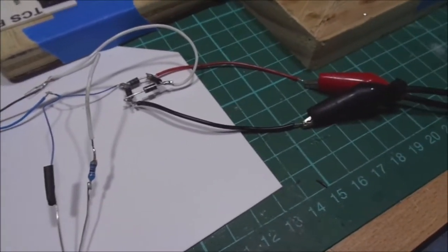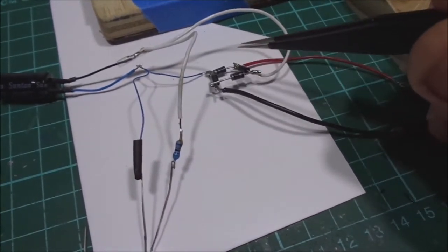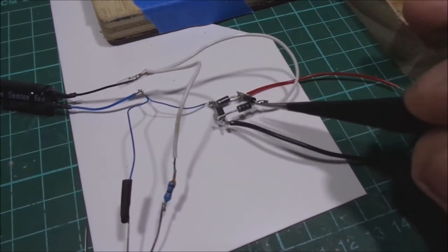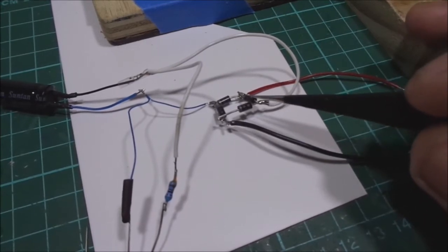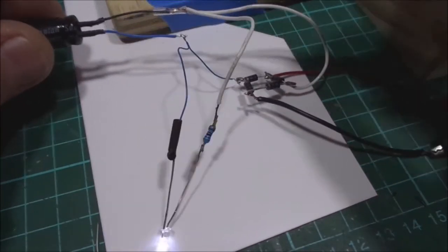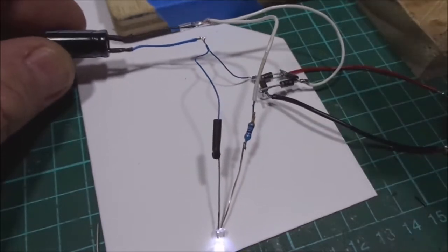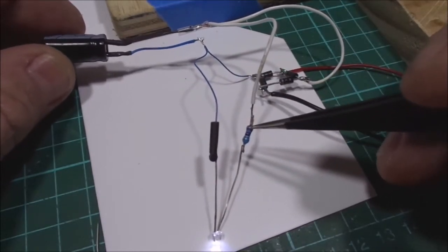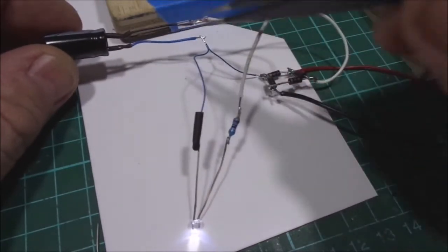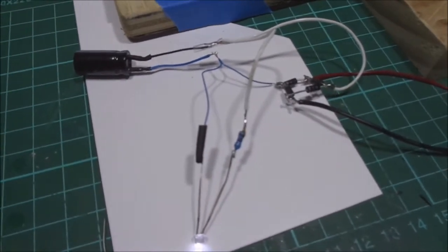You can see we've got the lead on. All we're doing is we've got track power coming in there — DCC track power — coming in to the two outside of the bridge rectifier. Then we've got the white which is the ground or the negative, which is DC. We've converted using the bridge rectifier — we've converted AC into DC. I've jumped in that capacitor, the 1000 microfarad capacitor, and that's going over to the resistor. I always use the negative for the resistor, and from the positive output DC we've got the jumper wire going into the capacitor so the capacitor is sitting in line storing up power.